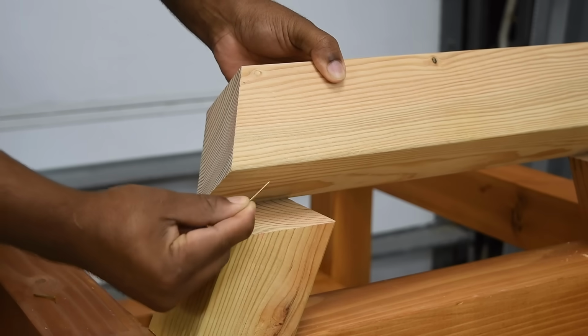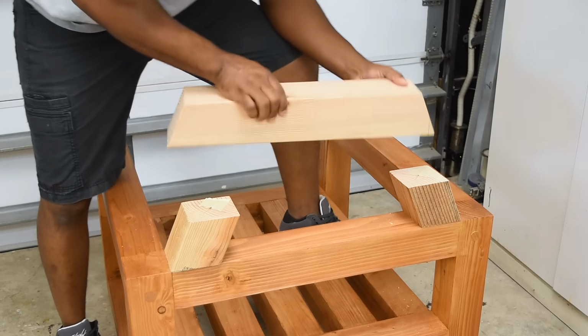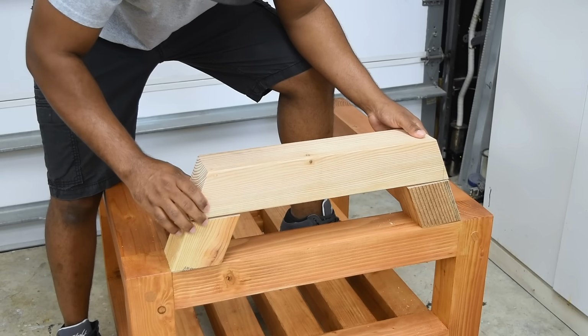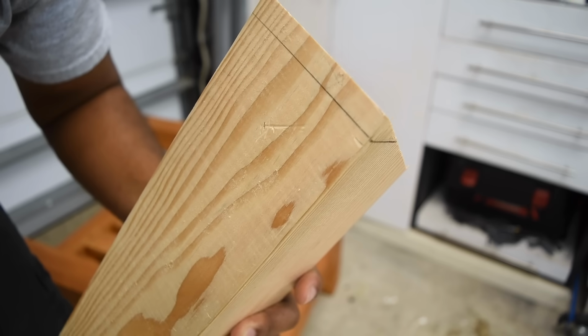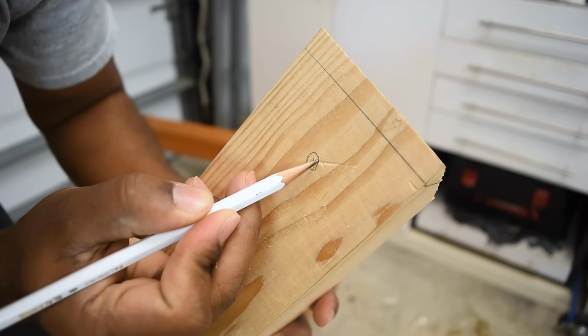take a small nail, place that in between the two areas that you're trying to join. Now don't be afraid, you can add 1 nail, 2 nails, or 3 nails in here, but whatever it takes, just tape them down. This way nothing moves when you apply pressure. And just like that, the mark is now transferred to both parts and you know exactly where to drill.